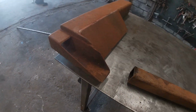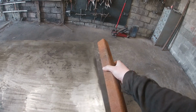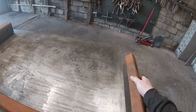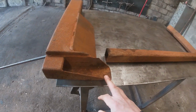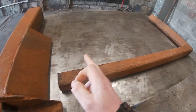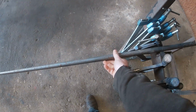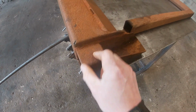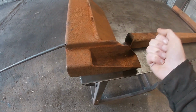But I need to widen it a small bit, but I can't widen it too much because then this L bracket will dip like that when the car goes on it. So it has to be tight a certain amount. Then my plan is just to put a couple of weld beads along here as spacers, and then this bar, this is the 1-inch bar I'm using, just going to weld it out. The little weld dot bubble will get caught on that bar just to stop it.